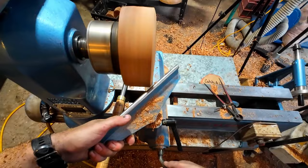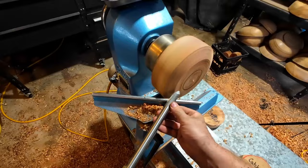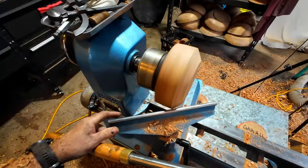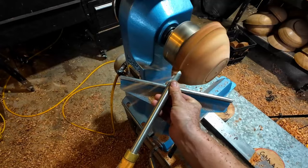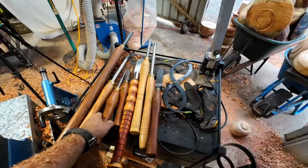Never stand in front of it when you're turning because you might get hurt. I've got a rough bowl shape with a bit of an ogee. When I'm not under the pump — no show to get ready for — I'll practice a push cut. Tool rest in, find it, drive it: go in, out, and back in, pushing with my right hand and just keeping that tool down on the rest. If you lose it, just come back and get it.